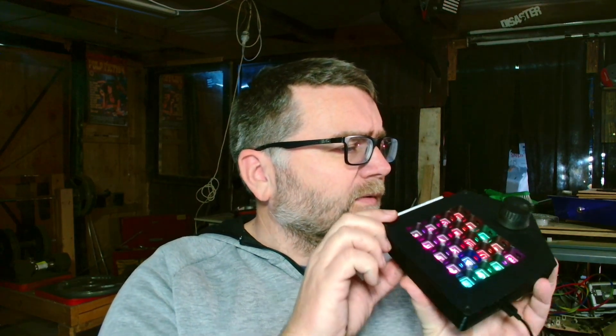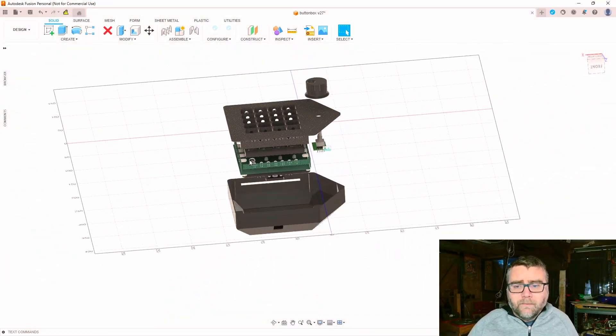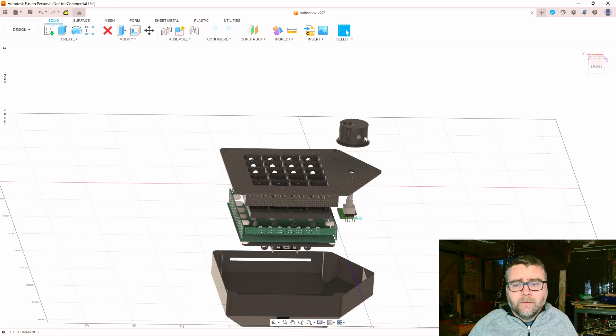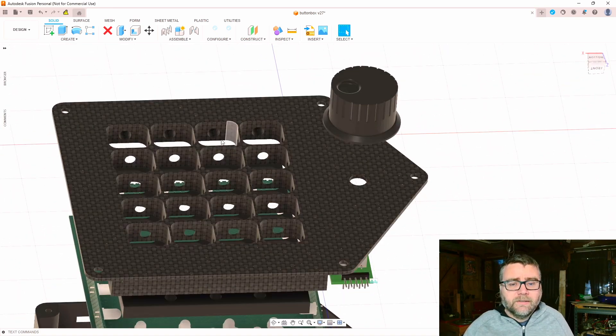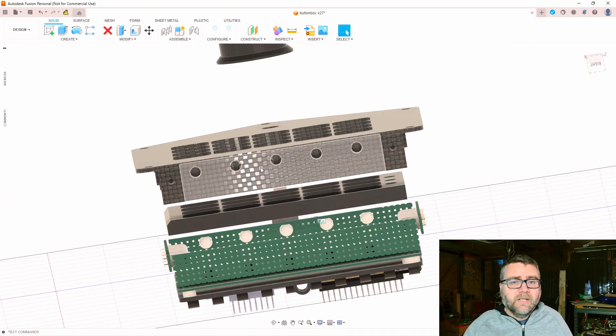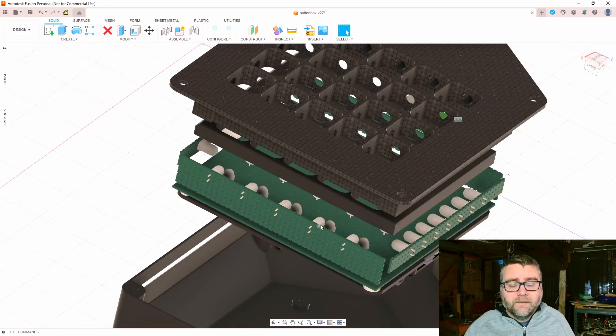In each of these edges, there's an infrared sensor on one side detecting the infrared beam being emitted from the other side. So let's have a look at the design. It's made up of about four or five different pieces. We've got the dial on top which goes onto the encoder where we can choose our colors or whatever. The front face has holes in it, and within one of these holes it's either an emitter or receiver of the infrared signal. It works in a button matrix.